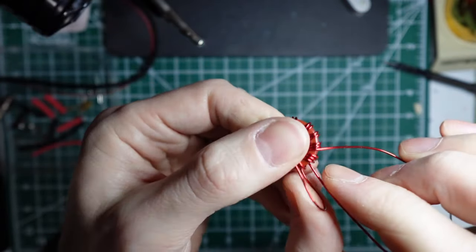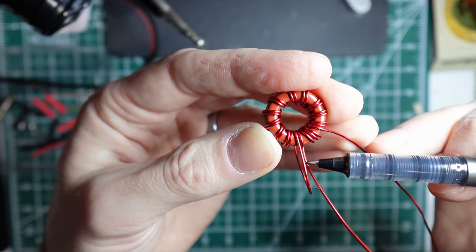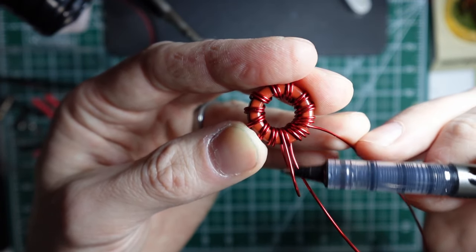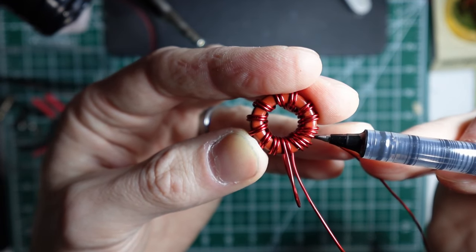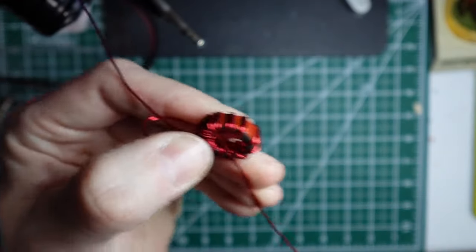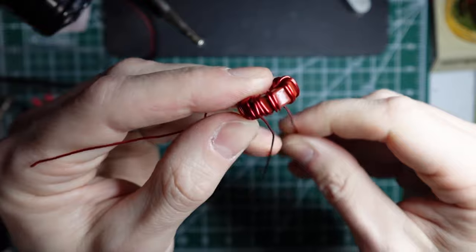It may be useful to take a look at a diagram of this. But what you'll see is we came up and we're going back through underneath the bottom. So we came up here at the end of our second set, a little bit of extra wire back down, and then it landed here, and it's going to continue to make a third winding on each set. That'll give us 12 total windings for each time around.